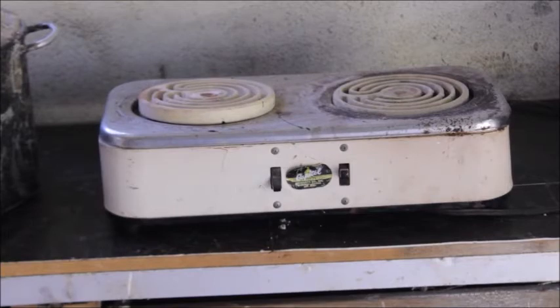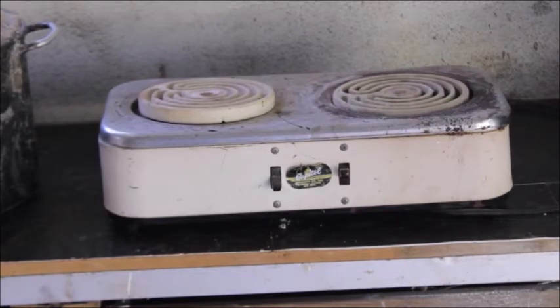You can put two or three molds in there depending on the size of the flask. I use food cans as a flask and they work great. If you're making small cans like a six or eight ounce tomato paste can, if you're doing a couple of rings, you can put about four of those in there at a time. Or you can put a couple of bigger cans like 16 ounce. In a 16 ounce food can I can get 15 different pieces of jewelry - and that's plenty.